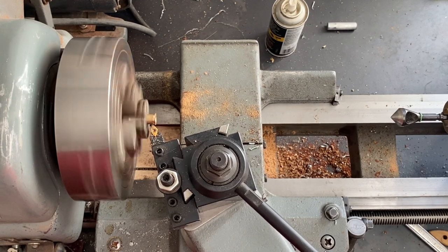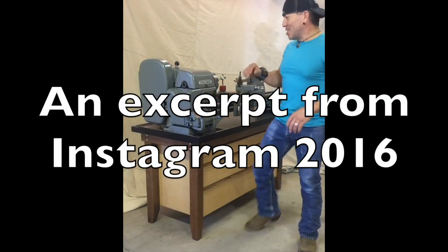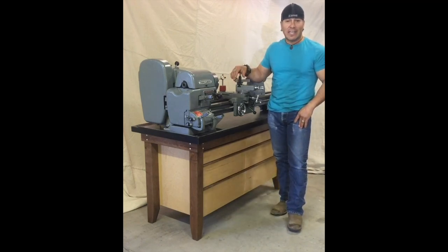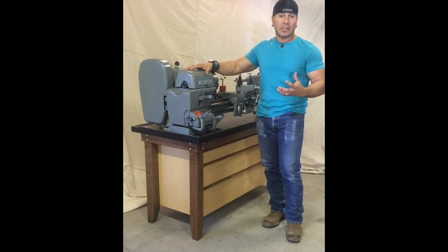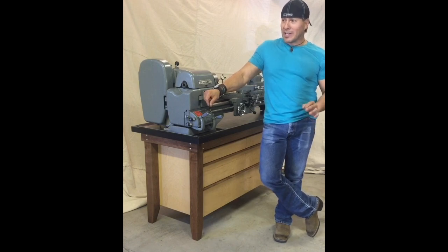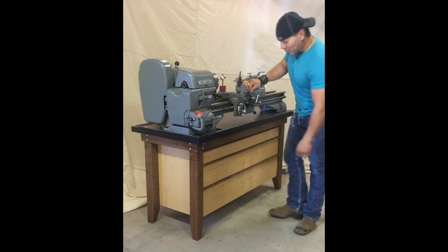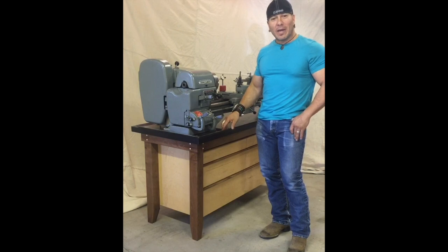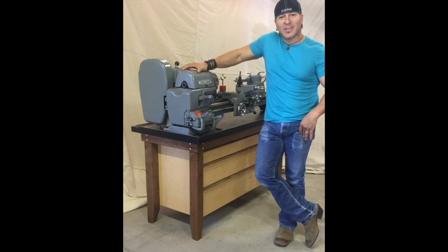A lot of these operations could be done with a simple drill press but I love using a lathe. This countersink in my chuck is what I'll be using to bore the door edge, and this piece of aluminum is just something parallel to match that gold colored insert to the correct angle. This was totally worth it and it worked out well. By the way, here's an excerpt from an Instagram post — the sound is horrible so I apologize. Good morning my friends, I just want to show you my brand new to me 1967 Atlas lathe. When I found this thing it was completely slathered in grease and grime — I completely dismounted it, cleaned it, and rewired it.